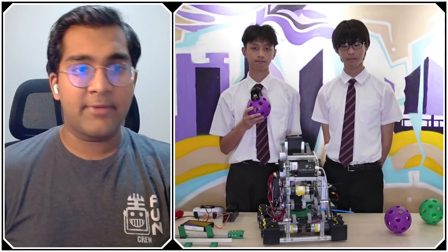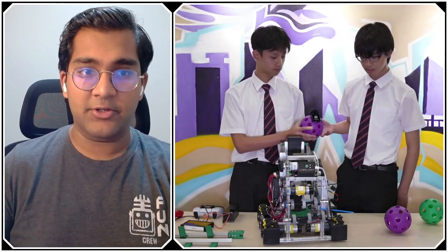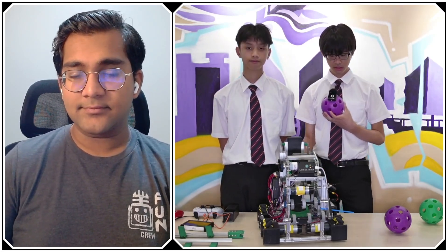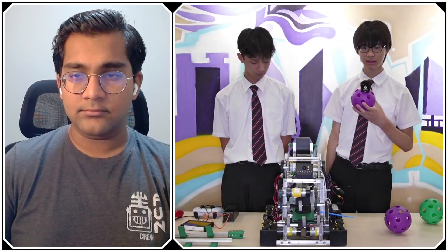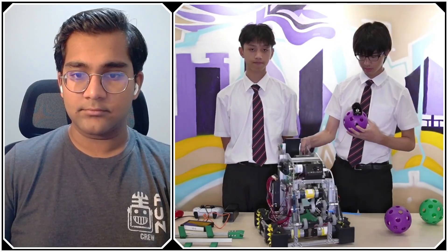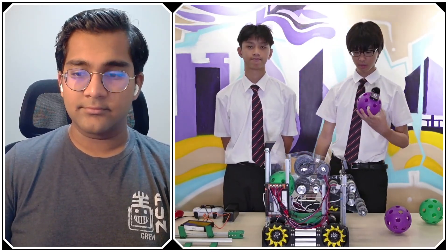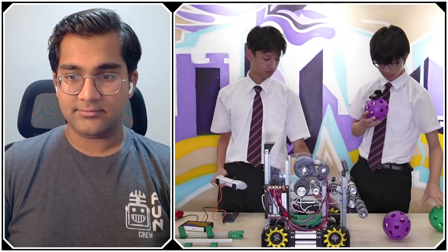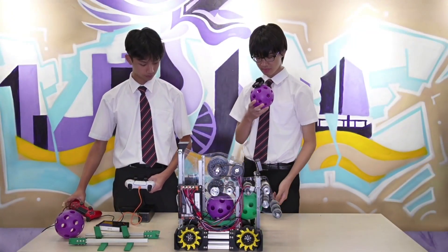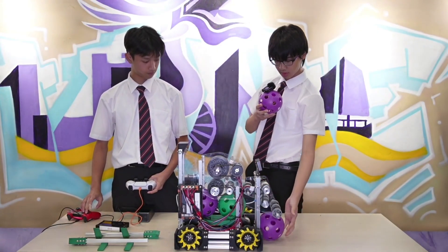On that note, when adding a funnel, how big will that make your robot? What are the dimensions of Basebot currently, and do you think teams can build on and expand it, or is it already pretty large? The drivetrain is quite compact — around 16 inches wide — and the length of the Basebot is around 16 to 17 inches, so there is still space for teams to upgrade and extend. The artifacts will go through the indexer and into the gecko wheel here, which stops them. If we want to store up to three balls, we can rotate the gecko wheel a little bit and have a third ball.